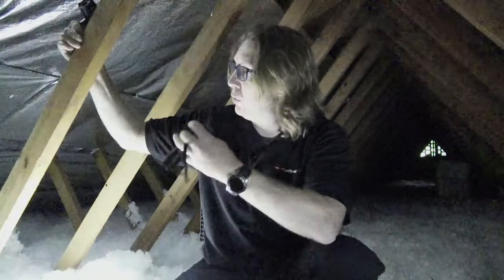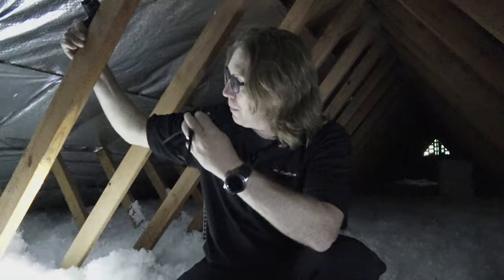So if you're thinking about doing a DIY project on your attic, most people's first thought is, well, I need to blow in more insulation. Well, that is true, but if you don't know what you're doing and you blow in insulation and clog all the soffit vents around the edge of the house, then you're going to create a high humidity problem and possibly even a mold problem in your attic. So one of the things you need to make sure you do is install baffles.